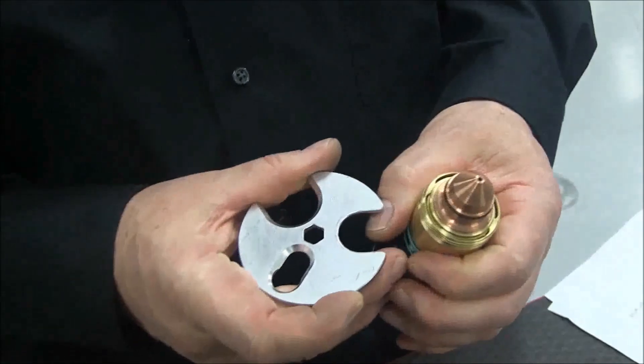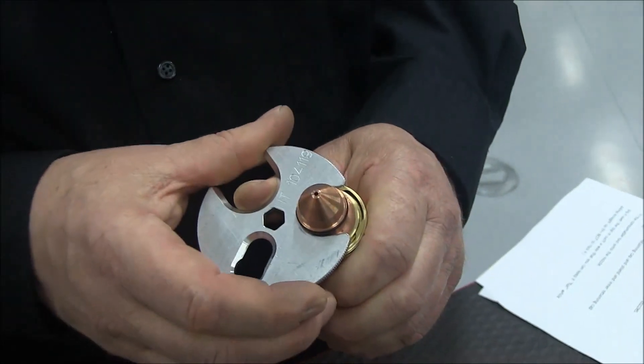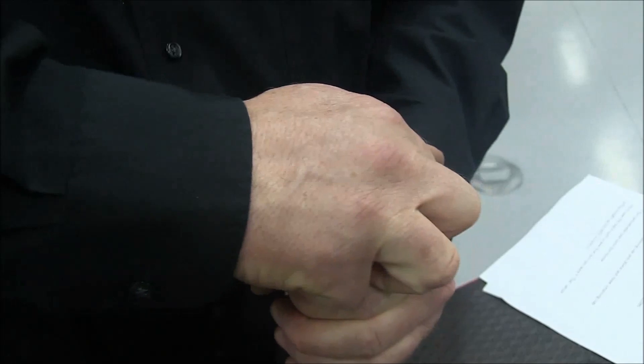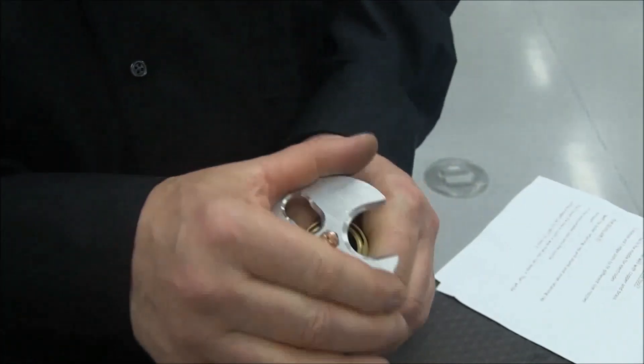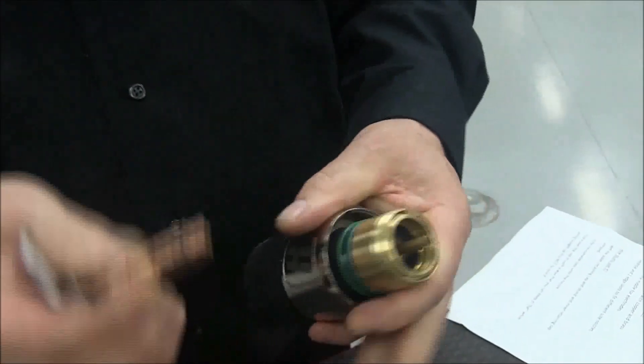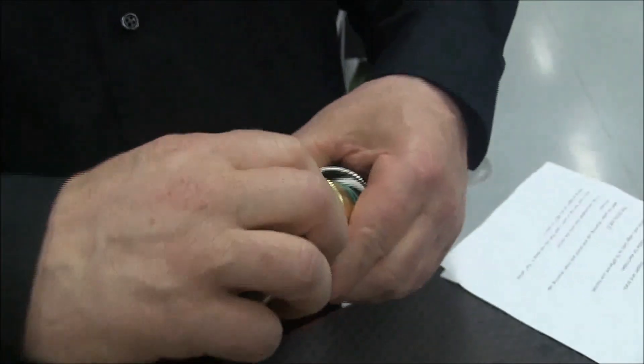Fairly similar on the XPR. With the retaining caps removed again, we see the nozzle. We find the right size slot to engage that nozzle and then grip it so we can pull straight out of the torch body. Same hex to loosen the electrode, but this one's just a quarter turn, so it's much quicker and easier to remove.